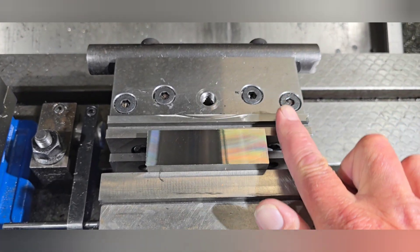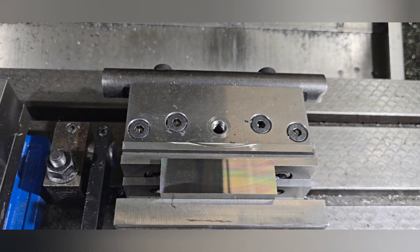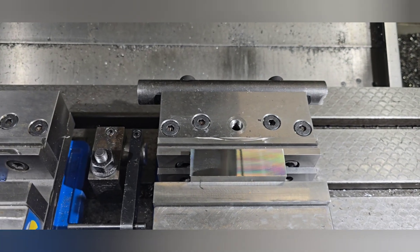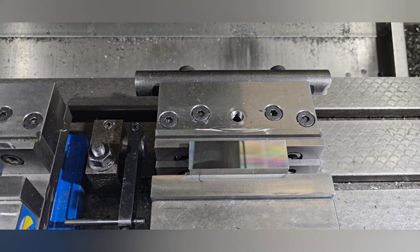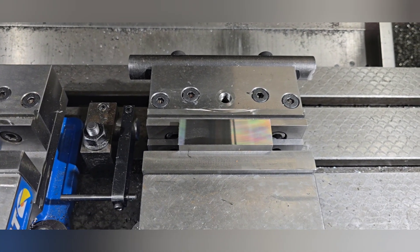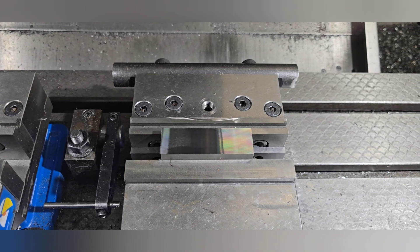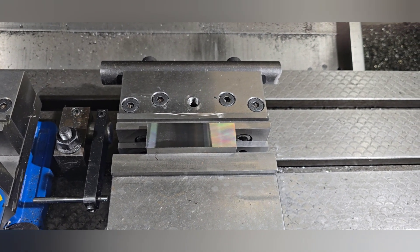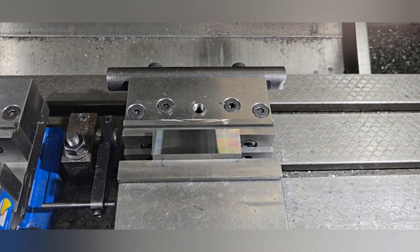Being that this part is three and a quarter inches long, a three inch face mill would have to come at it from this side and it would take much longer. You could take a deeper depth of cut on a face mill, but if you take light cuts like I just did — that was 15 thousandths — light cuts tend to wear out the inserts.